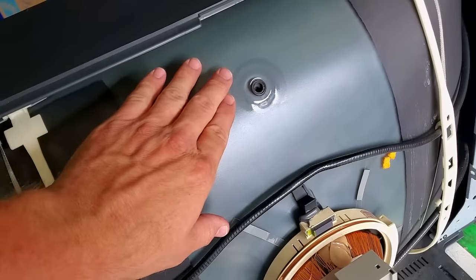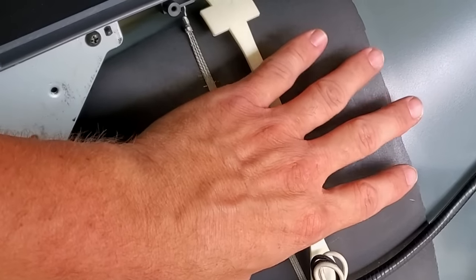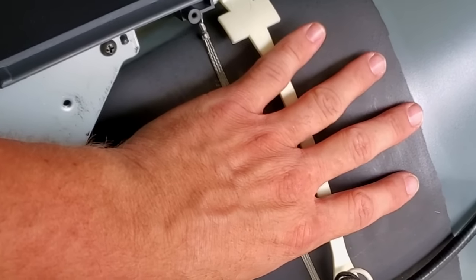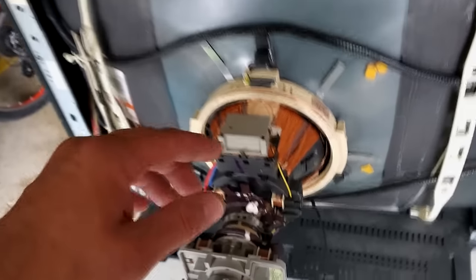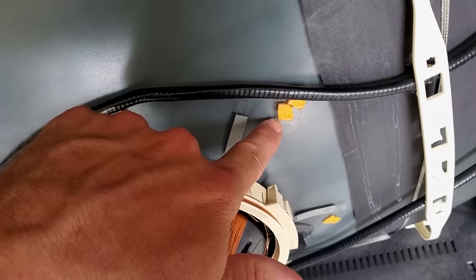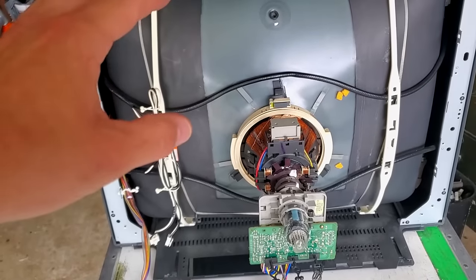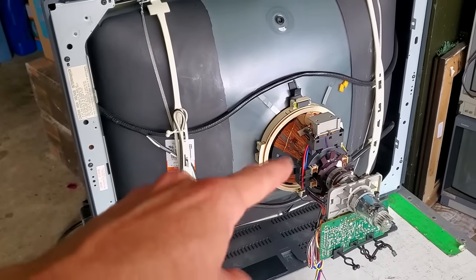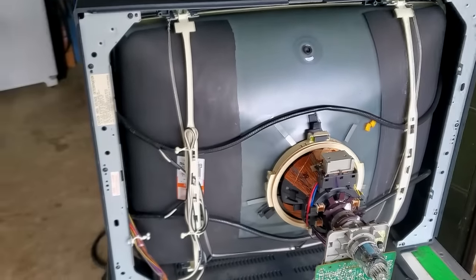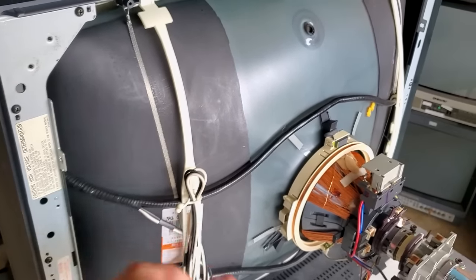Here's what the back of the tube looks like — here's the anode cap area, which has been fully cleaned. This is the darker-tinted aquadag coating over here, so you don't want to be heavy on the cleaning because it's important that it remains in place. What I noticed during inspection and cleaning was that someone had come in and adjusted the convergence rings and also removed some magnets that would have been installed by the factory for purity reasons. Once it's turned back on we need to check and make sure we don't have to make adjustments to the convergence rings or add strips or magnets back.